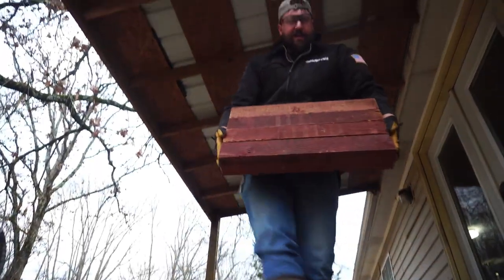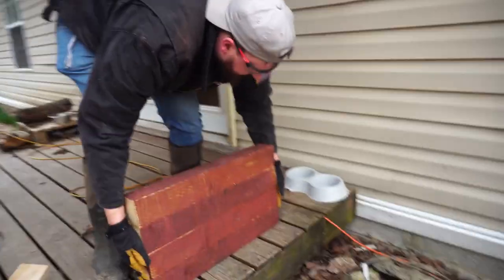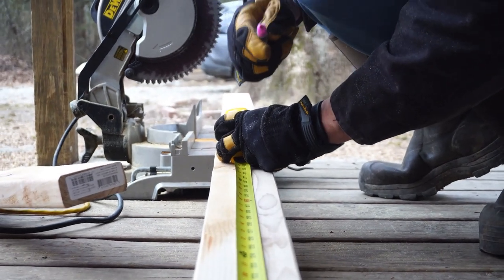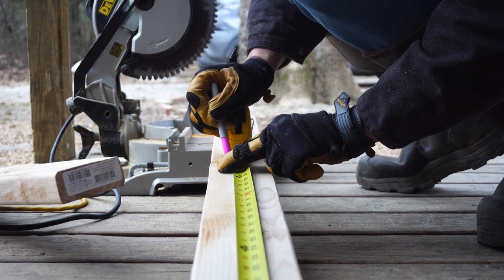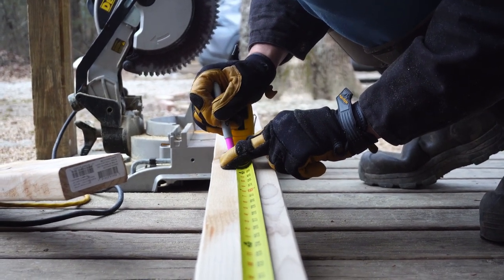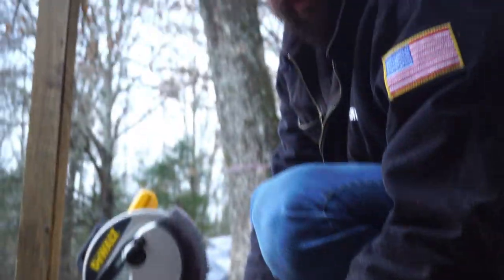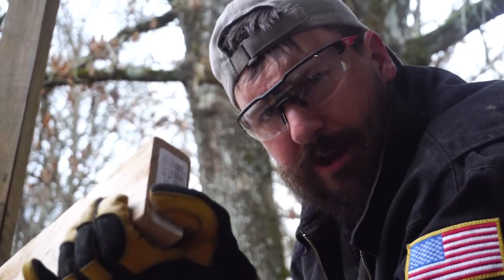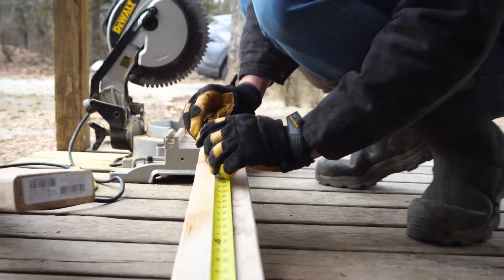With some science, I have deduced that all four of these are the exact same length. So the exact width of the base — I am choosing to be three feet and three inches. Three feet and three inches is because two-by-fours, which are supposed to be two inches in width, are actually an inch and a half. And you're going to see that overhang actually comes in handy in a moment.